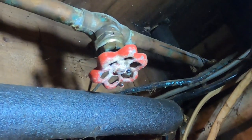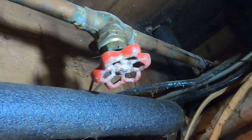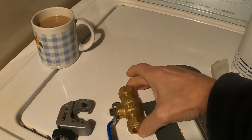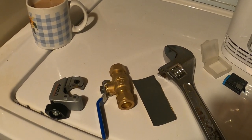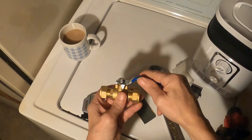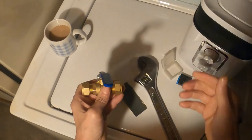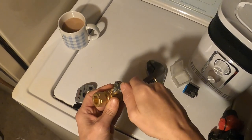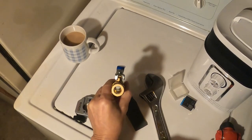I can't do that if this is leaking. I will show you how to do that, but I'm going to show you with the outside spigot because that one doesn't even shut off now. This is what I'm going to replace that valve with - it's a compression fitting valve on both ends. Main reason I'm changing the inside valve is I don't particularly care for those multi-twist valves. The packing on them does wear out over time. I much prefer these types of valves because I like just the quarter turn to shut it off rather than the multi-turn.